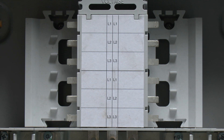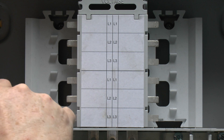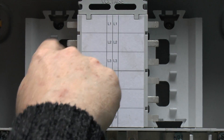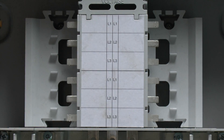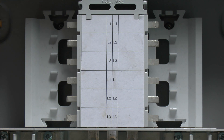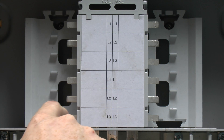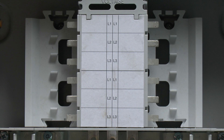This is the top section where the outgoing devices will fit. In this one, you've got up to six on each side if you're going for single-phase circuits, or for a three-phase one it basically fits over all three of those. Unlike domestic consumer units, although the devices are similar, they actually fit horizontally in here — the line connection comes in at the bottom, going horizontally, and then your outgoing wiring connects on the sides here.